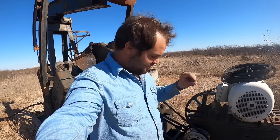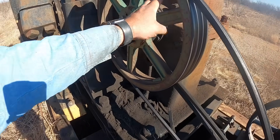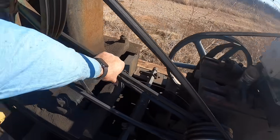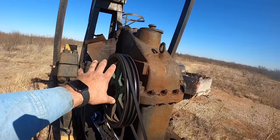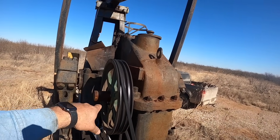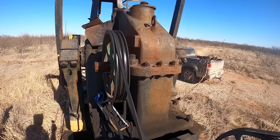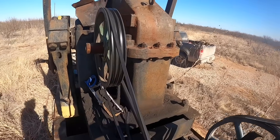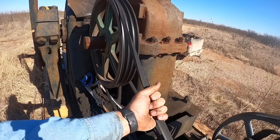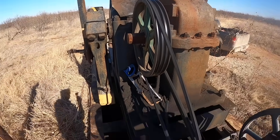Let's get after it. To start with, I need to explain what triggered this maintenance event. Like a typical Monday, somehow it rolled this belt off and got it wound up in the sheave, pulled tight, locked everything down, and blown the fuses in the fuse box. This gearbox has got a ratio of about 10 to 1. Most big units will have a gear ratio of at least 30 to 1 or higher. What this means is there's a very high load on these belts — it takes a lot more force to turn this shaft because of the lower gear ratio.